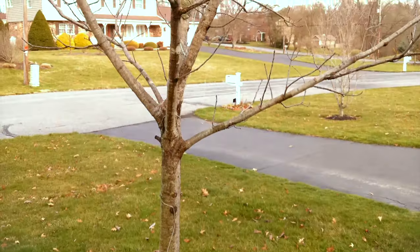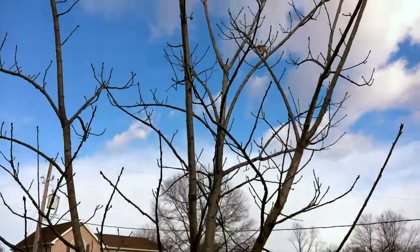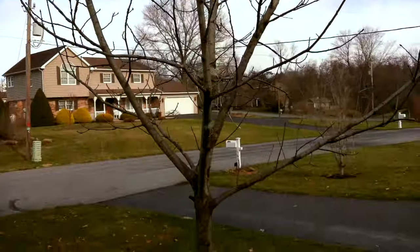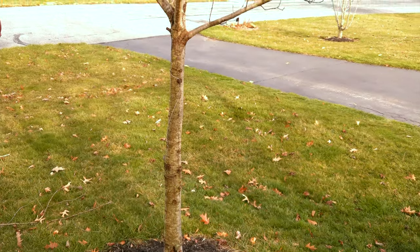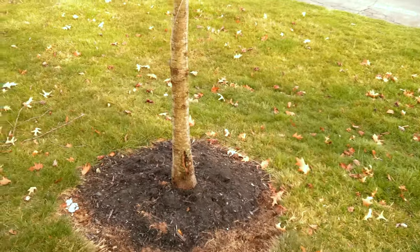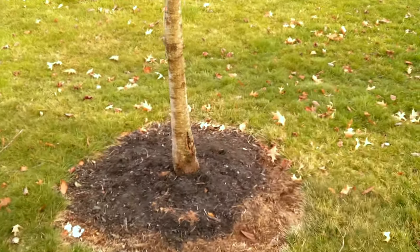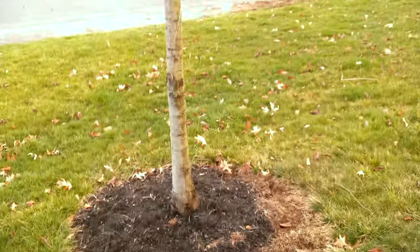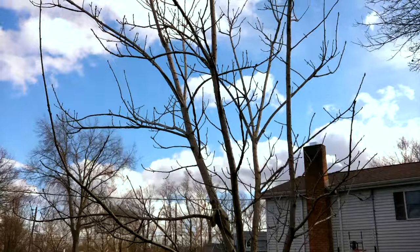And we're going to expect some roots that are just as stout. The other thing I wanted to mention is to make sure that you have the dig site marked for utilities. Because the last thing you want to do is put your shovel in the ground and hit a power line or a telephone line or the internet line. We want you to be safe and we want the homeowner's property to not be destroyed or damaged.